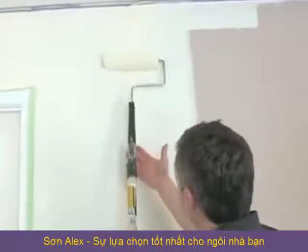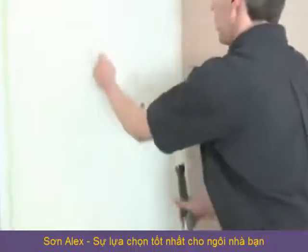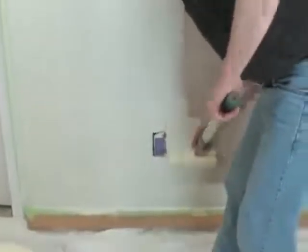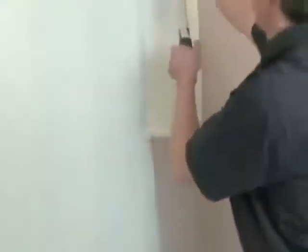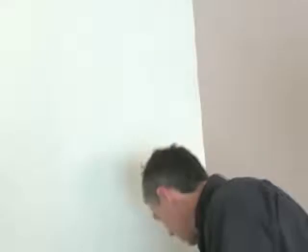And the final thing is just to lay the roller on the wall and gently let it roll down the wall. And you can see we're starting to get a little sticky here. It's starting to pull this. This being a first coat, we're really fighting the coverage. And I'm going to grab some more paint, lay it in the center, and roll up, rolling down and spreading through that. So 1 roller width, top to bottom, that's about a roller full, and you're getting about the proper amount of paint. Again, I'm going to spread this a couple times.